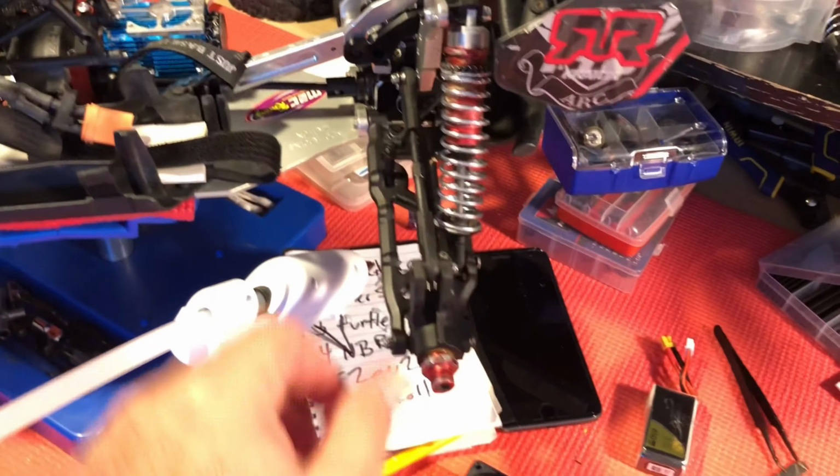So anyway, guys, the other thing I wanted to tell you was the modification that I'm doing to these fans to make sure that the shock mitigation is in place. These are already really strong fans, but I did find the weakness whenever I broke this fan, and I'm addressing it in two ways. One, I bought a different type of sorbothane. I bought 70 duro sorbothane instead of 40 duro, which is a little bit thicker, and it's also a little bit less tacky. The fact that it's thicker would have been a problem unless I had this longer screw, which you can see here is a good measure longer. So now whenever I tack this through, the threads are gonna go deeply through this with some red Loctite. It's not going anywhere now, which is the important thing.